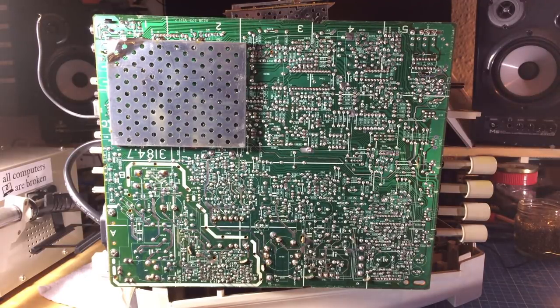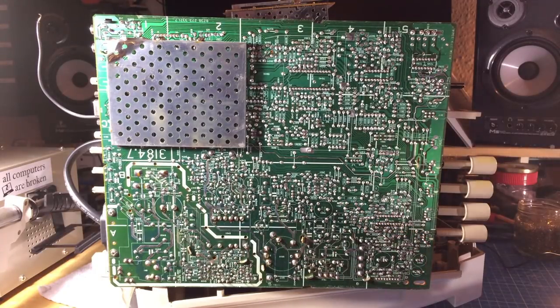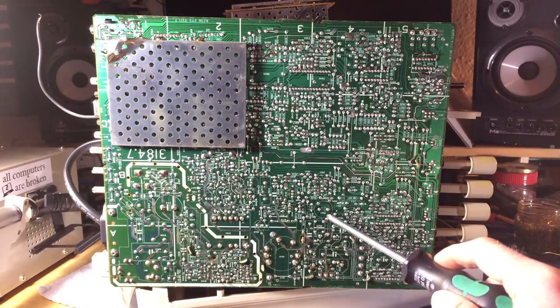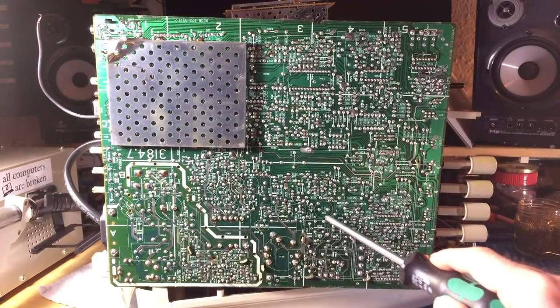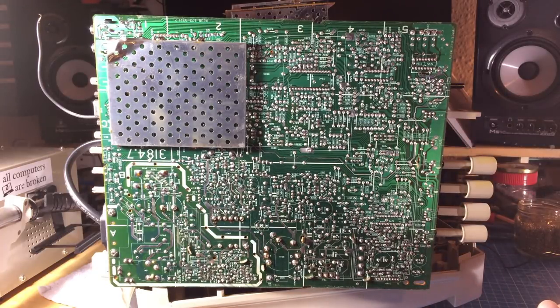As with the last Philips monitor I worked on, this is pretty convenient because it has all the components marked on the back side of the board. I want to discharge some of the larger caps. I can even see this is a bipolar capacitor — the polarized ones have one filled half, but this one has two open ones. It's designed to be serviceable, which is pretty nice for something made in the mid-90s — a lot of stuff back then was already not designed to be serviceable.